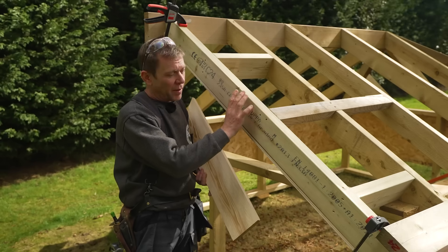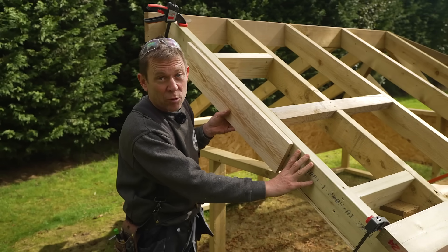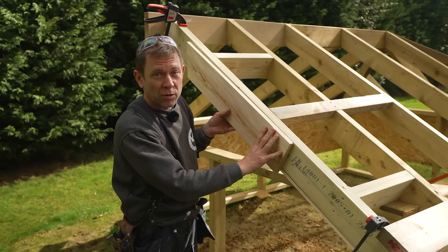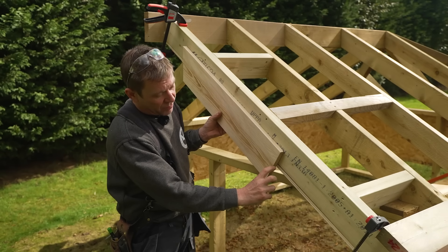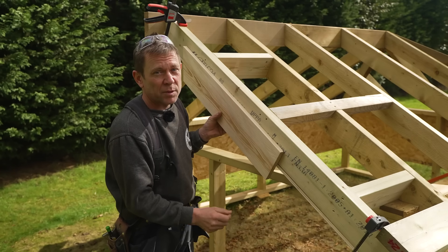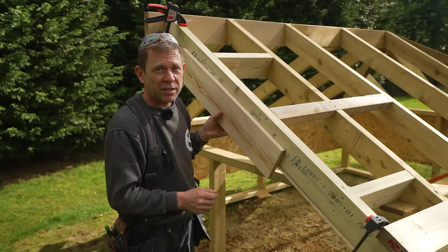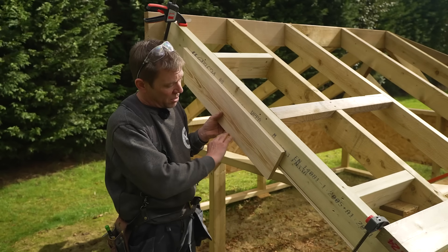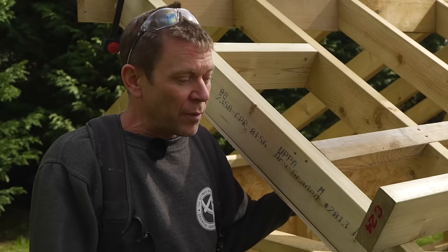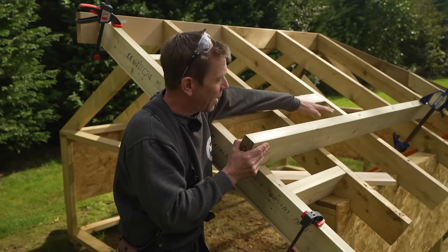On our demo rig here we've only got narrower rafters, but with the barge boards on now — if this was a real big rafter and a much bigger barge board — sometimes I'd pack these down so we don't end up with all the barge hanging down. But again it's customer's preference. We're just using wood here; you can use UPVC plastics, loads of different possibilities, even big scallops cut out to make it look really nice.